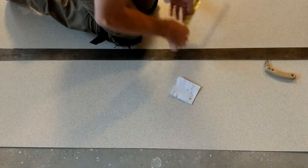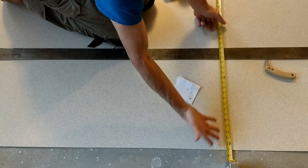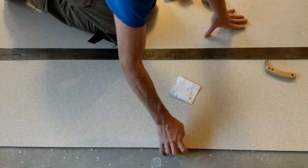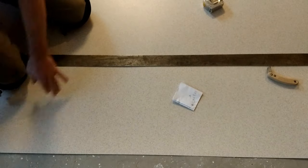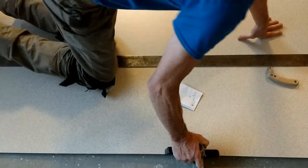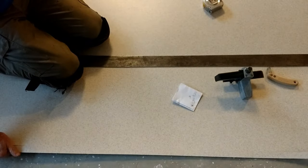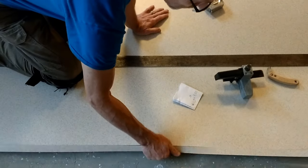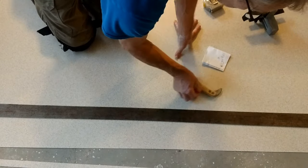From our 36-inch piece we need a 25 and a half inch deck and a five-inch backsplash, so we have a little extra. I'm going to trim the factory edge off with the slitter to give us a nice clean edge to start with. I'll cut this one with a single pass — it still snaps off fairly easily.